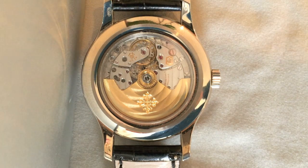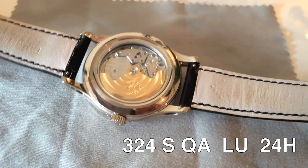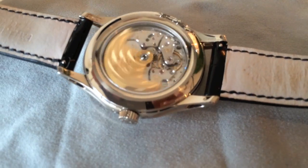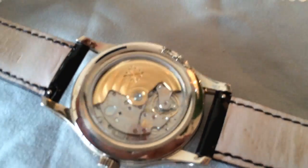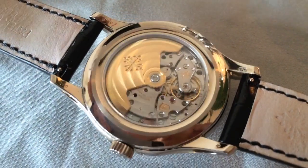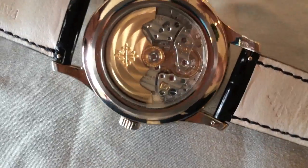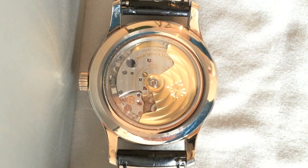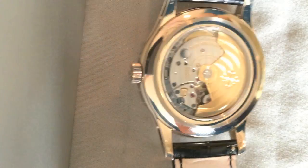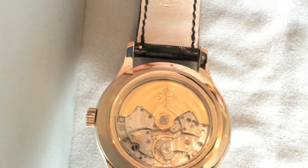Moving on into the specifics, this watch runs on the caliber displayed on the screen. This movement is automatic, meaning it is powered by the movement of your wrist. The winding rotor is in 21-karat yellow gold and rotates both ways, however only winds the watch unidirectionally. Obviously, you can also wind the watch manually by turning the crown. The movement has 347 parts inside, which I think is astounding given how small this timepiece is. The power reserve is between 35 and 45 hours.